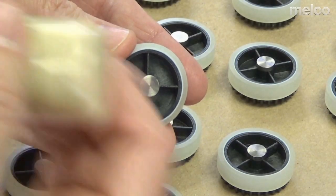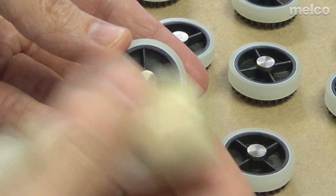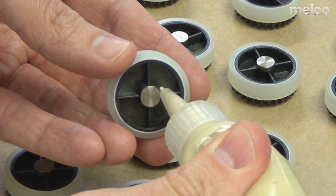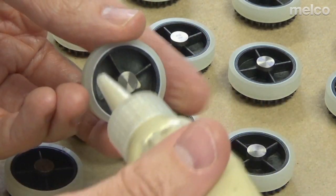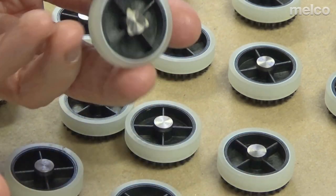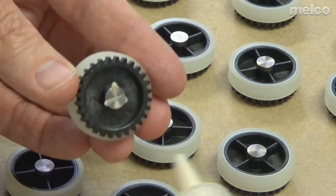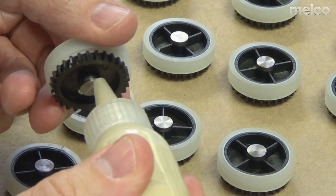Now that we've cleaned these, we need to reapply grease. I'm going to use the EMB polymer grease and apply it to the side of the hub — three small dots, kind of evenly around in a little triangle. I'll squeeze a little bit out and then scrape it off onto the side. It's not on the face, it's on the hub edge. Then I'll flip the roller and do the same thing on the other side — three dots, scraped off onto the side.